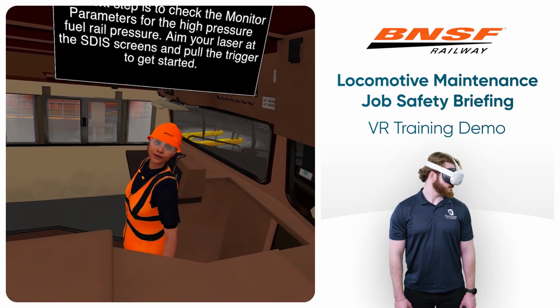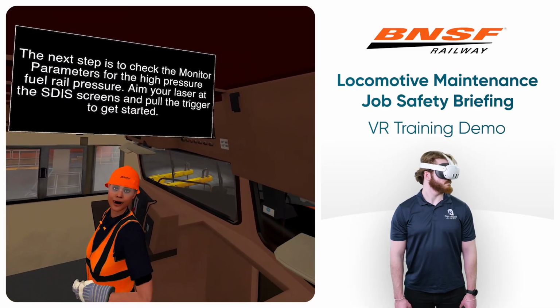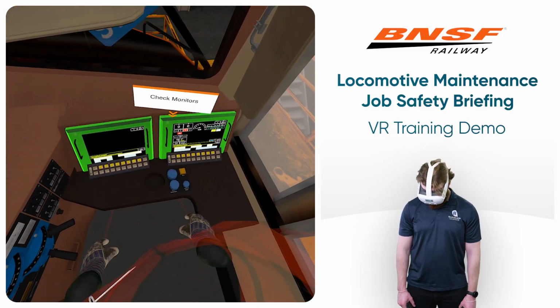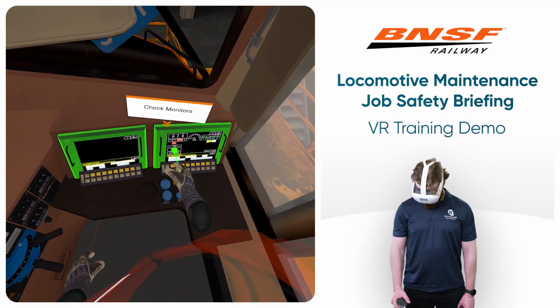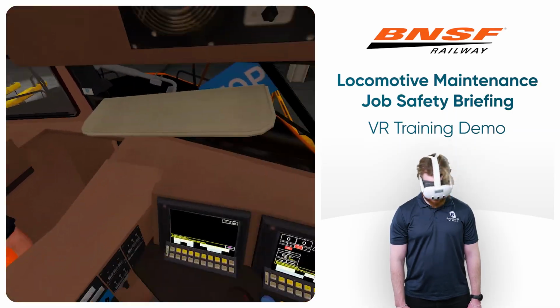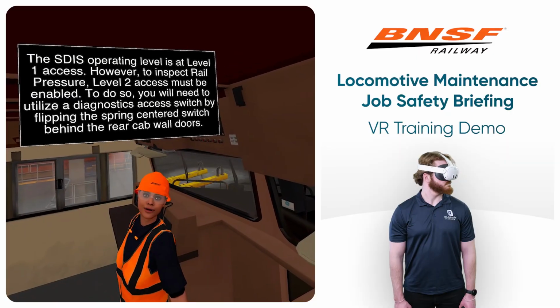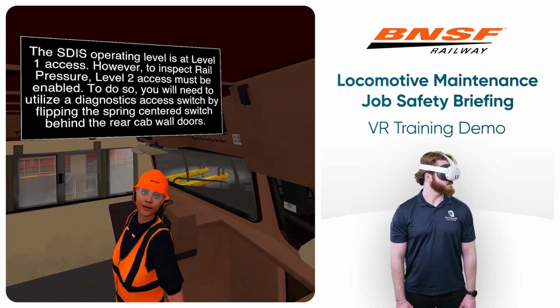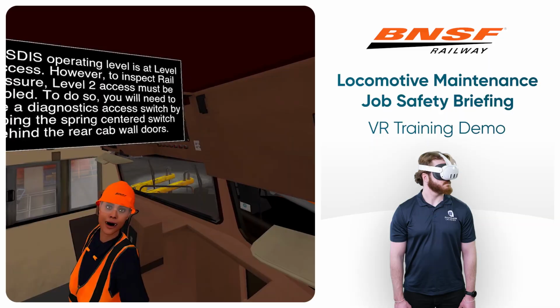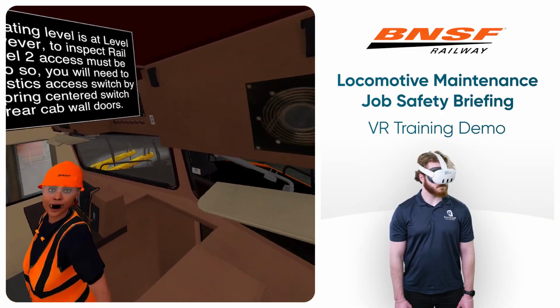The next step is to check the monitor parameters for the high-pressure fuel rail pressure. Aim your laser at the SDIS screens and pull the trigger to get started. The SDIS operating level is at Level 1 access. However, to inspect rail pressure, Level 2 access must be enabled. To do so, you will need to utilize a Diagnostics access switch by flipping the spring-centered switch behind the rear cab wall doors.